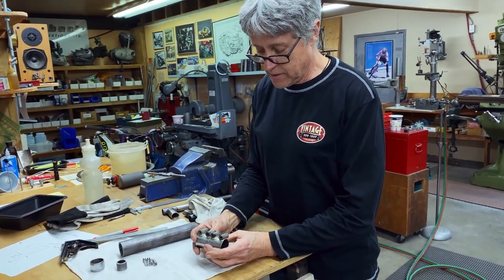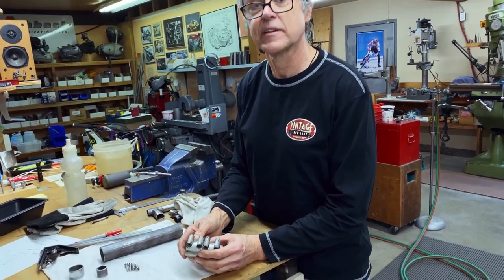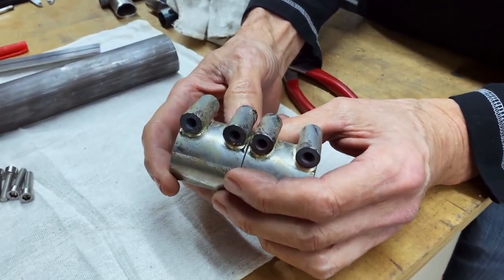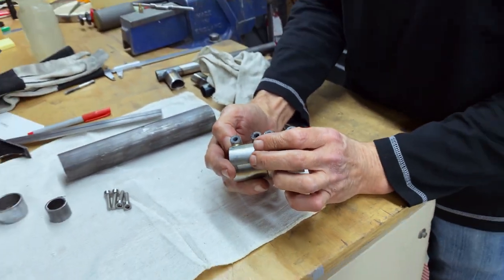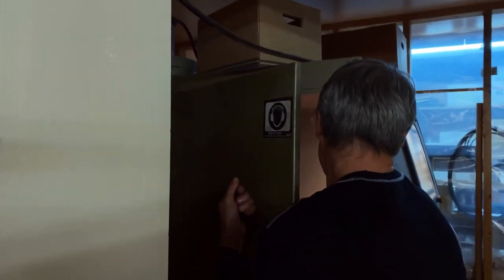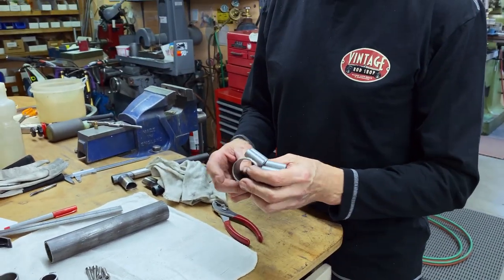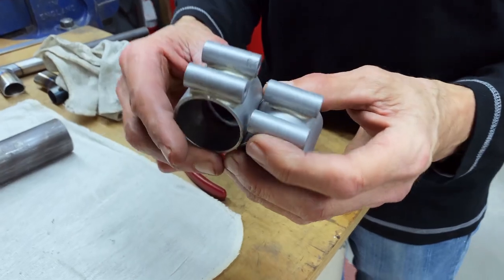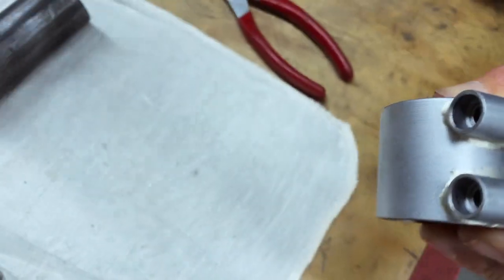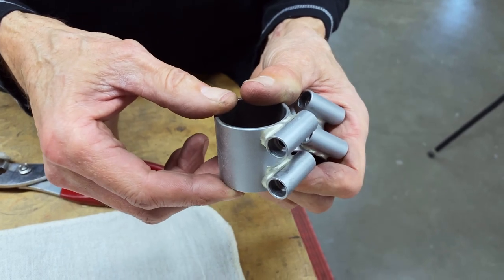I've soaked these in hot water to take off the flux, and what we're left with is a little bit of blackness from the heat. I'd like to put them in the bead blaster to take that off and clean them up a bit - that's the easiest stage to do it. After bead blasting you can see it's a lot cleaner and you can see if there are any little lumps. I've got a little spot there - I need to file off that little bit of braze. Sloppy. Aside from that, it looks okay.